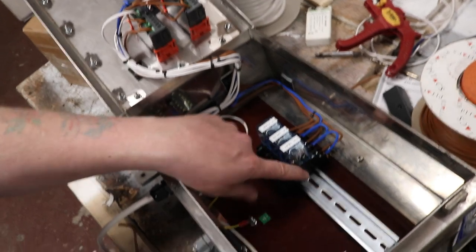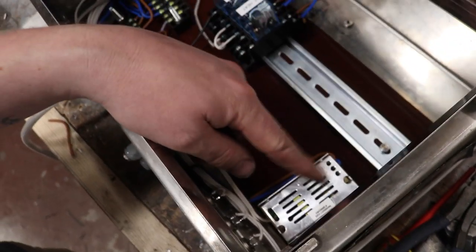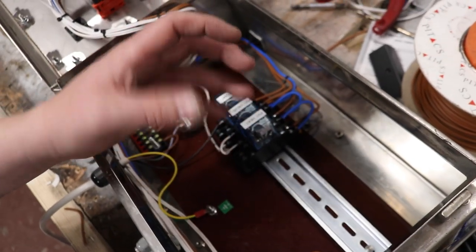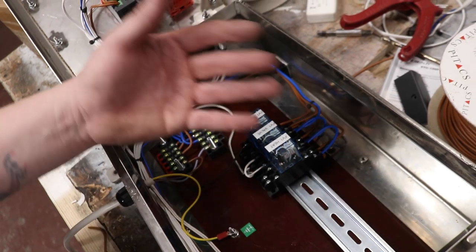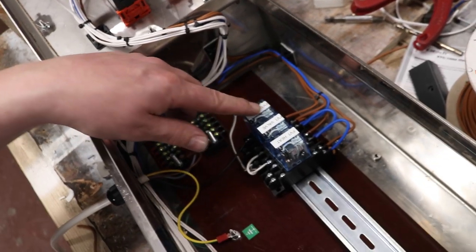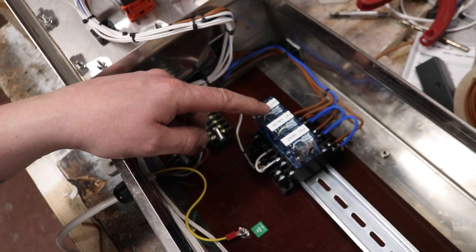That's what these three relays are going to do here. I'm hoping we can run it all off one power supply as well. This power supply is going to actuate the motorized valves, which will control the flow into the fermenters with the glycol. The pump can just be daisy chained to all the other relays when they arrive.